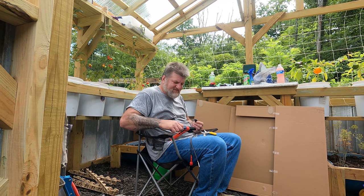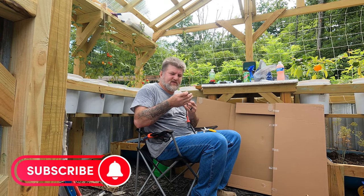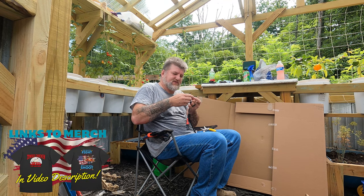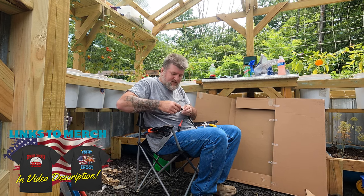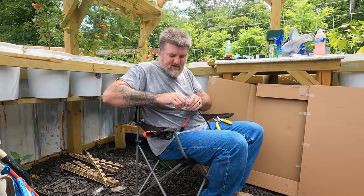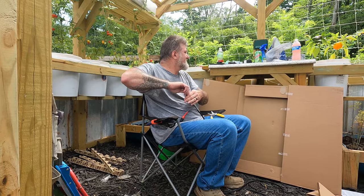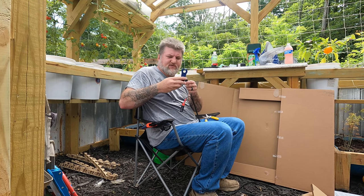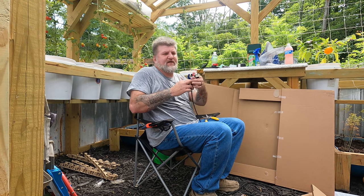It's tricky at first if you ain't ever used one before. Anyway, same deal — you just take this apart. Here's the nut, you put it on there. Here's the watertight seal that goes on it, you put that on there. And then you put this on and you'll feel it click — just like that. I heard it click. Then you just push that watertight seal right back in the bottom of it like that, and then put your nut on. It's like a compression fit — you tighten it up and it squishes it where no water can get in there. Just tighten it up as tight as you can get it. These little wrenches that come with some of your fittings are pretty good to have to tighten them up. And that's basically what you got right there.